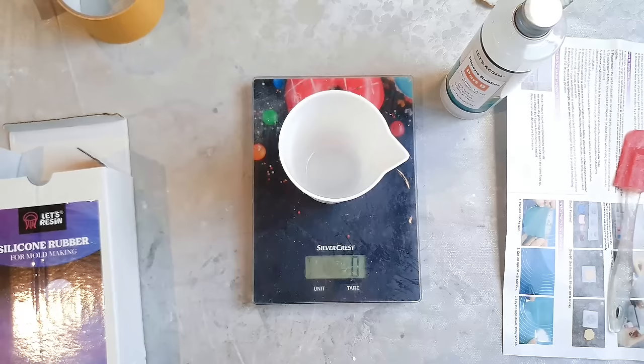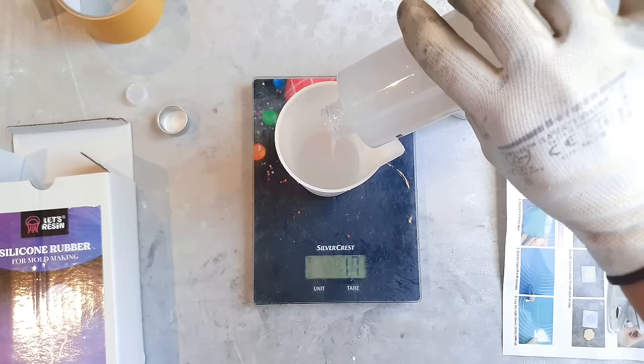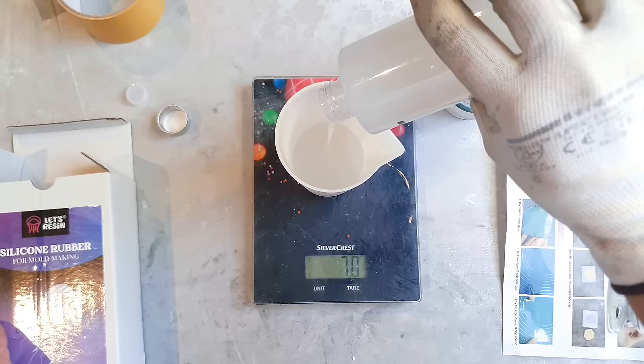So for example, I did this in the morning and then I demolded around 5 in the afternoon and they were ready. I always use platinum silicone. It's better quality than cheaper silicones, especially for resin. This makes it better for torching since it can tolerate higher temperatures. And personally, I've never had any problems with my molds overheating.